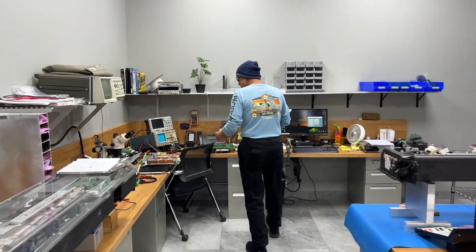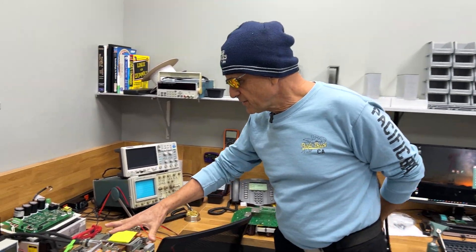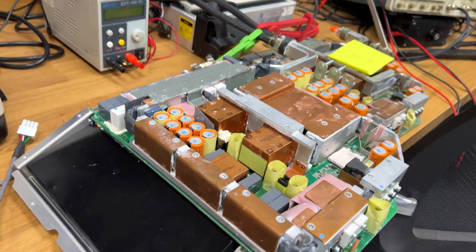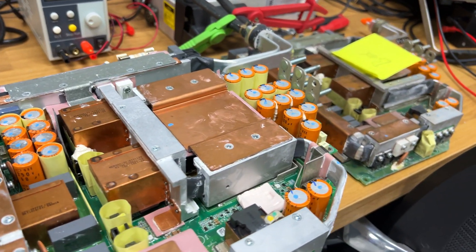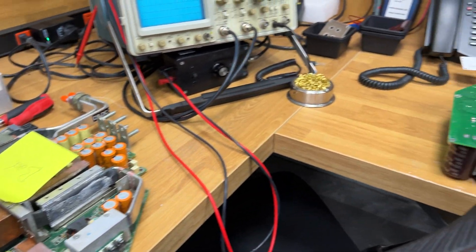The DC-to-DC converter that we saw out there inside that Roadster battery pack looks like this on the bench, and there were two versions — a Martech and a Delta. The first one was considered inferior, so there was a later version that evolved.